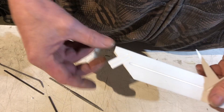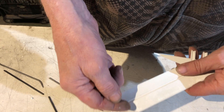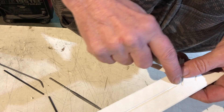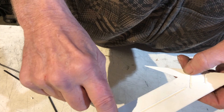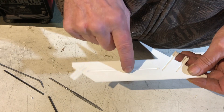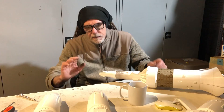You're asking yourself why doesn't that idiot use a dremel and just run it down the inside of these? Well, if I used a dremel the speed of the cutting head will melt this plastic - this is thermoplastic. As soon as you get it warm it's just going to deteriorate, and internally there's probably a honeycomb structure with a very thin wall that's printed in to seat whatever you're supposed to put in there. I don't want to melt that because if it breaches through into the honeycomb structure I won't be able to get glue on it. So I'm cutting lightly, feeling when it's getting thin with the file, and doing it by hand doesn't generate too much heat to melt the structure.